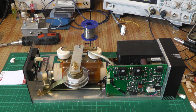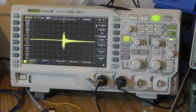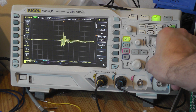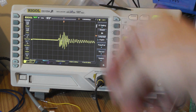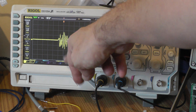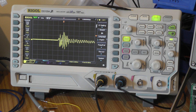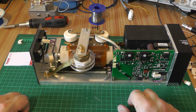Obviously this setup is not ideal — I can't get it back in the case with this very large spark gap hanging off the side, and of course it's spewing RF out into the room. Let's have a look at the oscilloscope. I have the probe not actually connected to anything — it's just hung on a nail on the back wall — and we can see quite a significant signal being radiated out into the room. This is the spark gap firing and essentially giving us a burst of RF. We're reading about 4–8 volts peak-to-peak, which is pretty significant given that the probe is just hanging on the wall behind it.